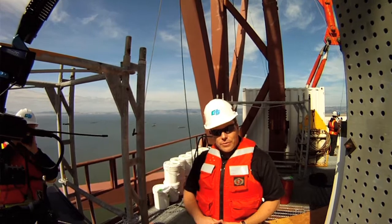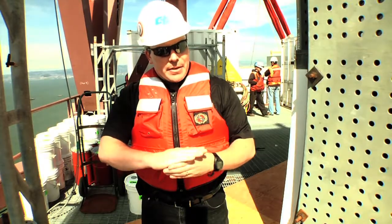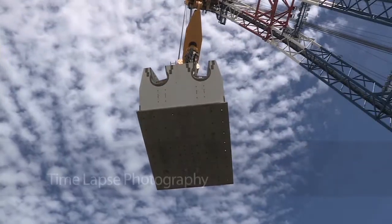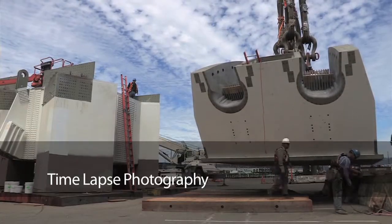The next thing we'll do in about a month is place a saddle that will sit right on top of this piece, and this grillage disperses its weight down through the legs. We did a test with the grillage and the saddle this week before starting this move. Absolutely — when you're going to do something this big and this heavy, you've got to make sure that it all fits together.